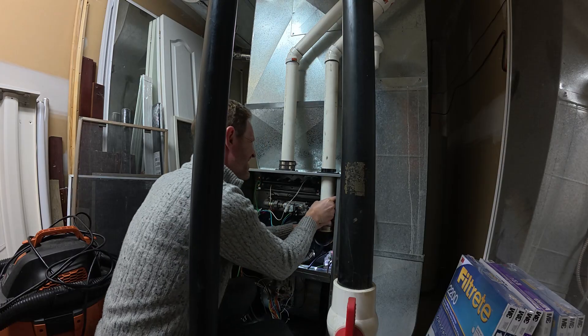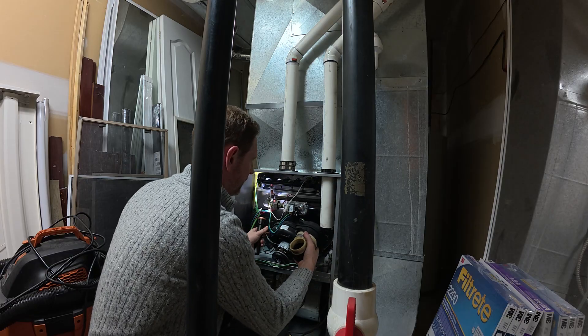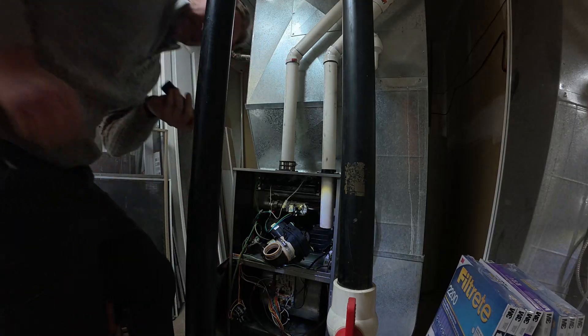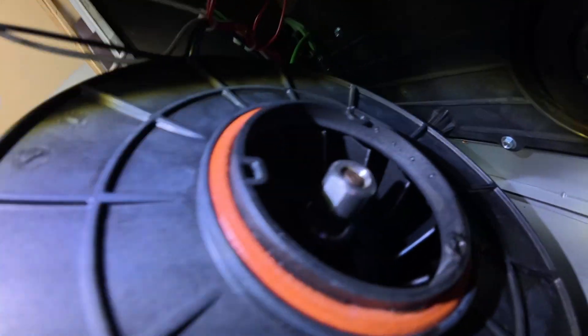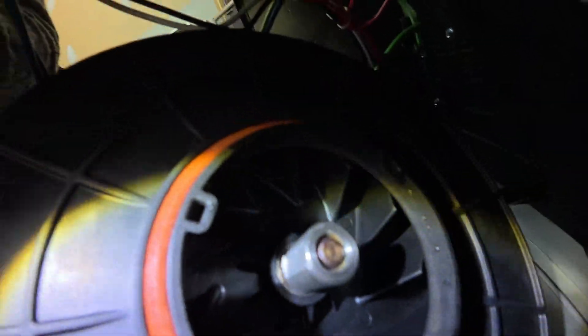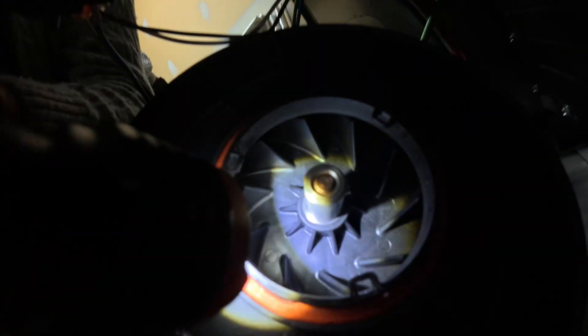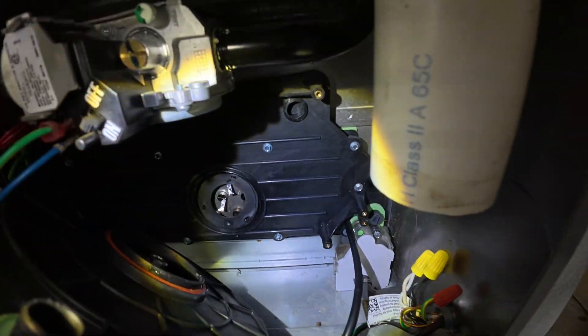As I pull this out you'll see in the video clip where I'm looking to see what kind of water I have. I grab my camera and flashlight because it's kind of dark. You can see quite a bit of water in there — in the whole system, including in the furnace itself. I'm flashing the light into the metal part where all the fins are that collect heat, which is the exhaust part after everything burns.